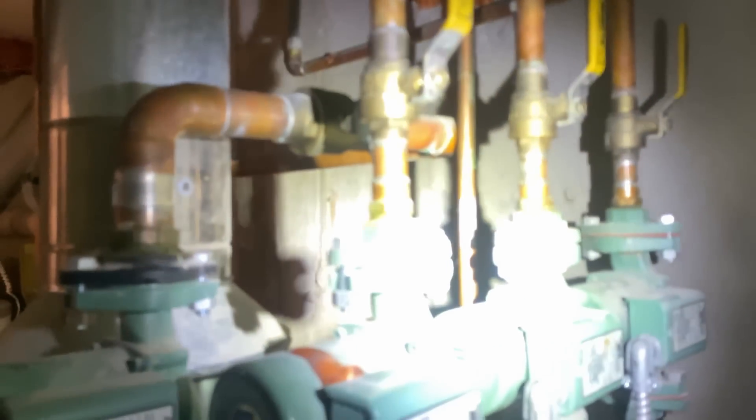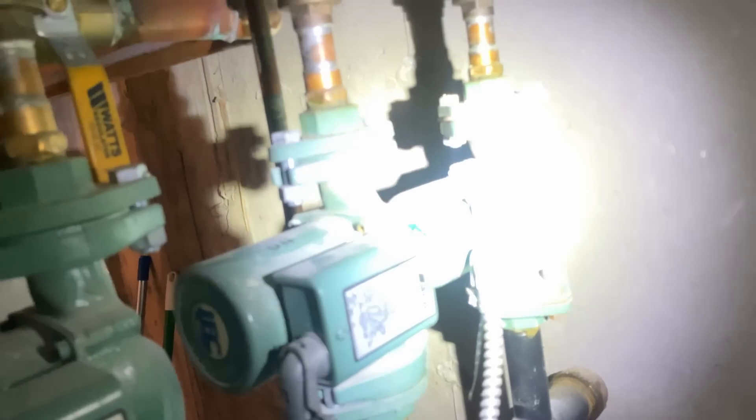Back to what I'm here for right now — you have this zone which is labeled 'DN' or 'ND' reversed. 'Up' is the upstairs, and 'downstairs' is on according to what's labeled here. So your downstairs zone is heating, and it's evident by this very hot pipe. Let's go to that air handler in the closet and see if it's hot, because hot air comes out of the vents, right?